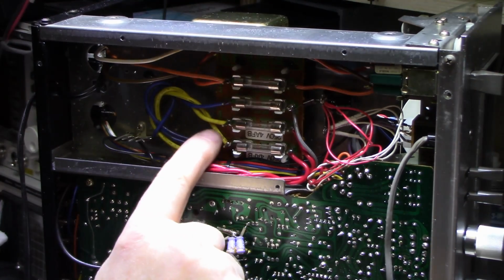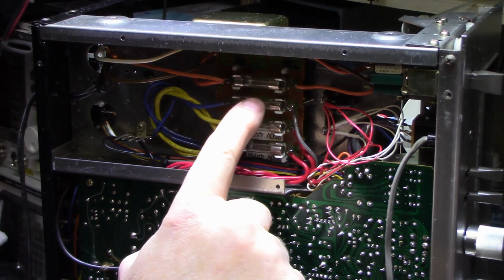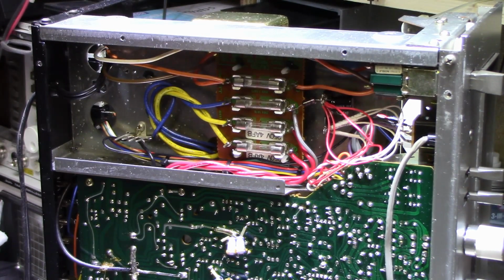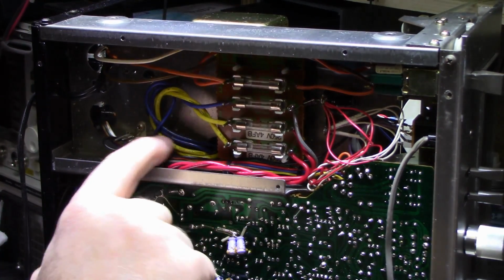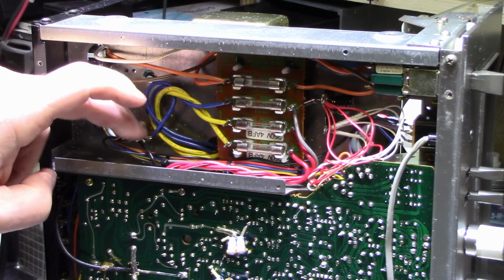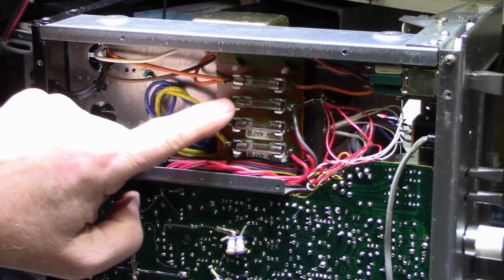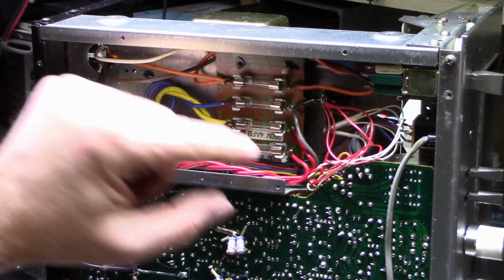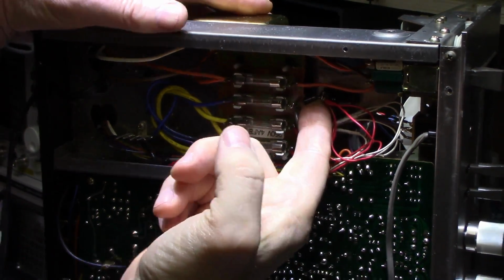The yellow winding is for the power amplifier. The blue winding is for auxiliary lamps, and I believe they also derive a B+ supply for some of the circuitry. So the blue wire from the transformer is grounded here on this pin. That's grounded, and then the other leg goes through the fuse, and then this gray wire goes off to the regulator. And what I did is I just added a diode, a single half-wave rectified diode.